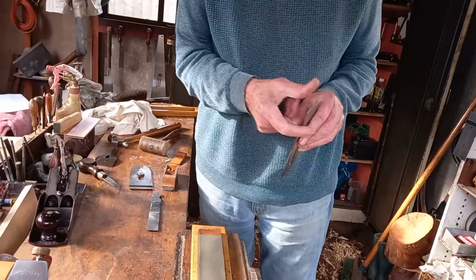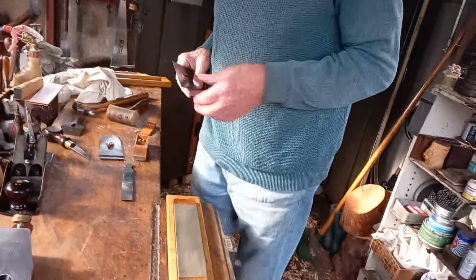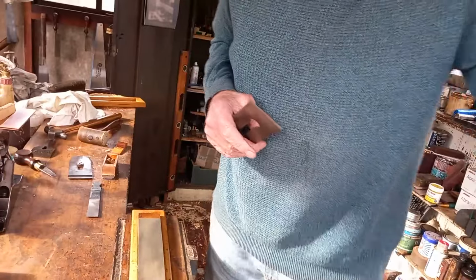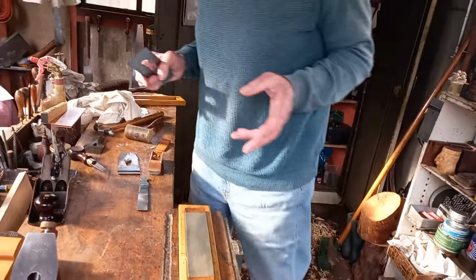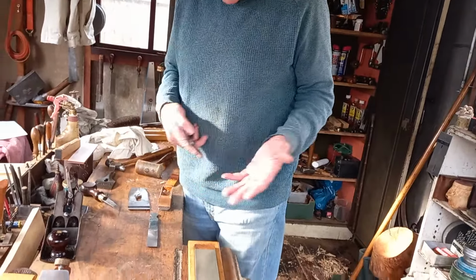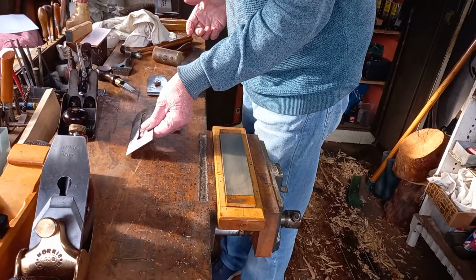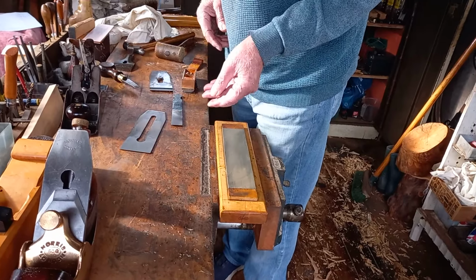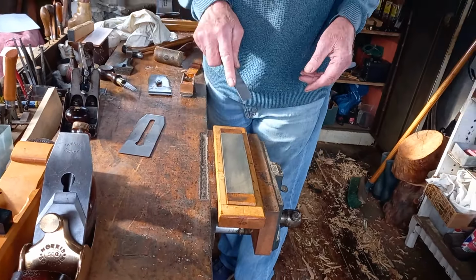that is sharp. Right, finish off like that if you want to. Some people finish them off on a leather wheel. I don't bother because it's not necessary. I can do whatever I want with a sharp iron the way I'm showing you. It's quick and easy. So that's how I do it. I do them all the same. And it's the first time I knew I'm doing them at about 30 degrees.